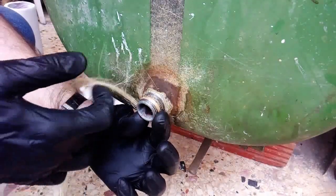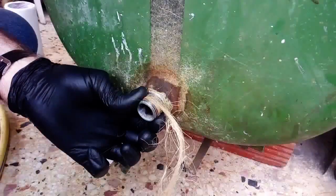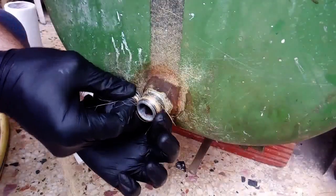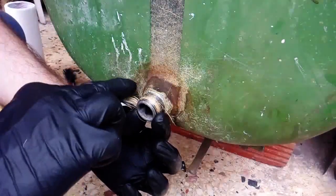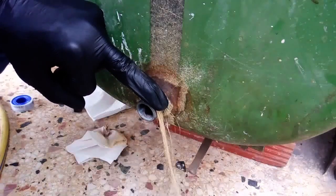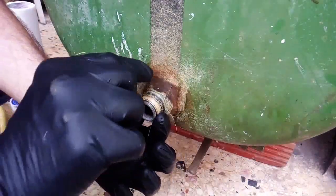I'm applying it slowly and cautiously, keeping the fibers tucked in and parallel with each other. The hemp fiber tends to form a rope on itself if you don't keep it level and flat on the thread. So with my other hand I hold it, and with the other I apply force so the fibers fit inside the thread.